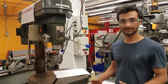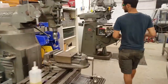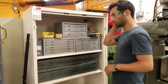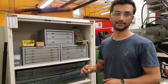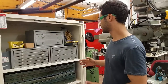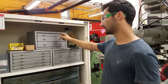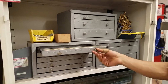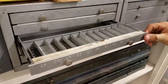Now let's look at different kinds of bits we can use. Most metal and wood drill bits are pretty interchangeable, as long as they aren't the pointed kind used in woodworking — that would just destroy it. We have fractional index bits here if you want a fraction of an inch, and these are numbered bits. If you want, say, a size 33 bit, you might find it here.